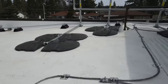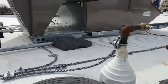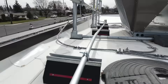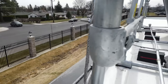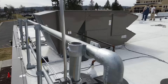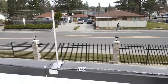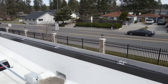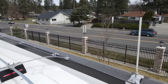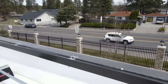Nice sweeping radiuses here. We have a gas pipe bond, and here we have a handrail — pipe clamps, a pipe base for the lightning rod. The lightning rods are field bent to fit around the bracket. This is an adhesive system with 18-inch air terminals. There's an electrical conduit bond.